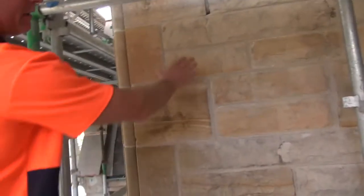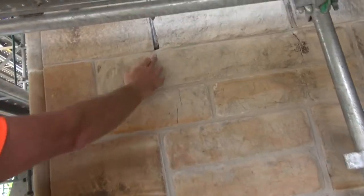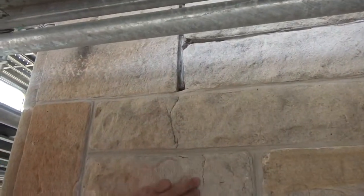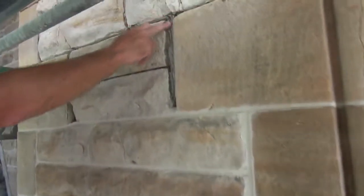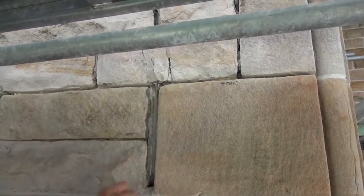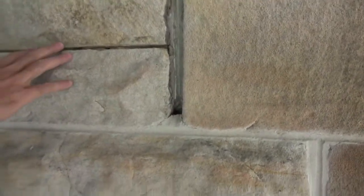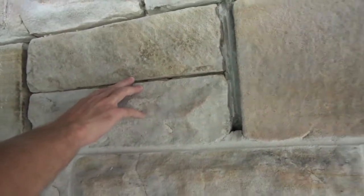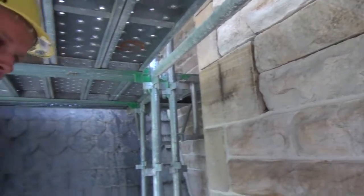This is the lower section of that buttress that has the majority of the damage. As you can see, we've been down two floors of scaffold, so over six metres, and it's still cracking down here. Again, large amounts of cement mortar have been put in — it can be up to sometimes 100 millimetres inside the joint, whereas a pointing mix is commonly found up to 30 millimetres. So it's over double what's required of a stonemason's mortar.